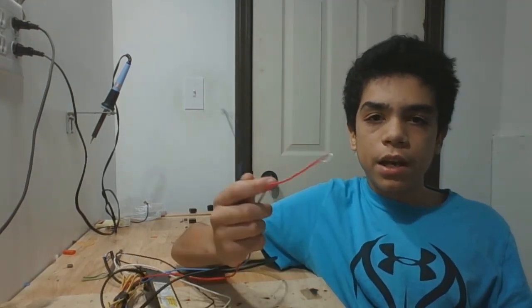To properly connect the ballast to your flyback, simply find a red wire and a blue wire, and connect them to two pins on the flyback that have a resistance close to 1 ohm. This will be the primary coil of the flyback transformer. Once you have made all of your connections, cover all the exposed wire with electrical tape to keep them from shorting out, which will blow the internal fuse of the ballast.